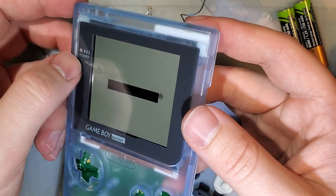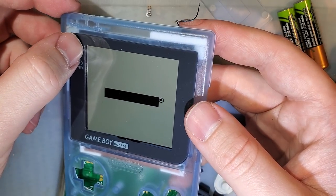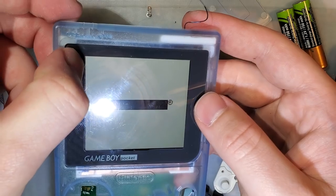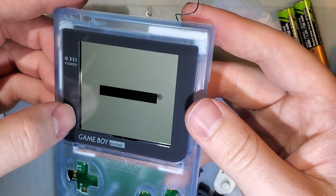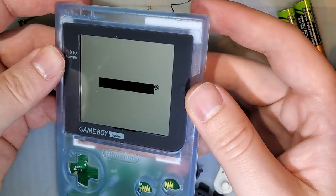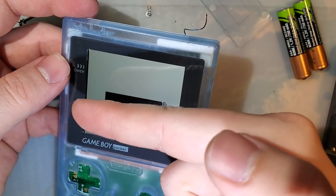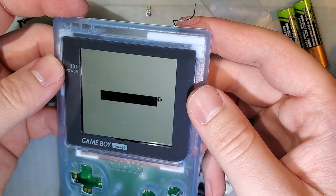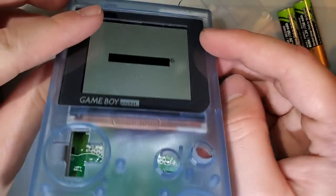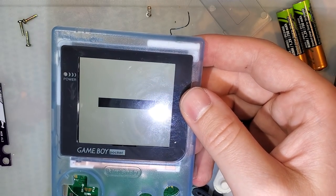Alright, now real quick, I'm gonna pause while I pop this LCD or this lens out one more time, so I can just give the edge a little bit of a trim, because as you can see on the left here, there's just some plastic flashing that needs to be taken care of. Again, still not great. I think it needs to go over and up like half, a quarter millimeter, and then up a half millimeter. And then it'd be perfect. But it's way better than I'm getting with my bracket, so there we go. I'll be back again.